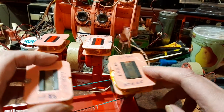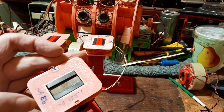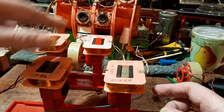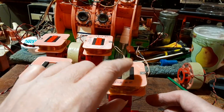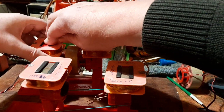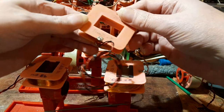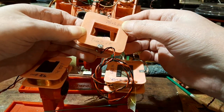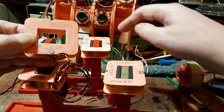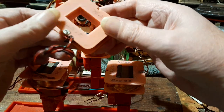This other side measured 1.5 ohms DC resistance and 93 grams — so I should have paired that coil with a matching one. I'm not sure I paired them correctly. I obviously used different wire for some of these. This one is 76.2 grams, so it's clearly not matched. It's been so long since I made these that I can't even read the writing on them now.